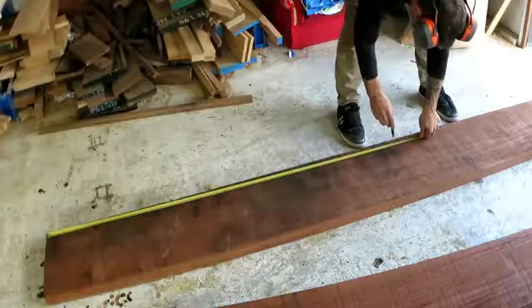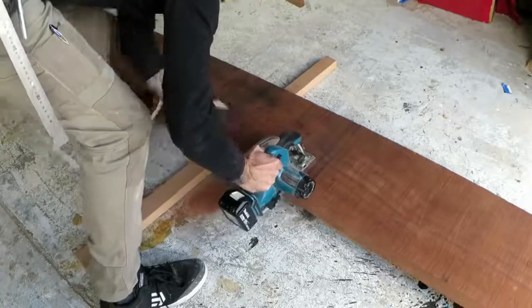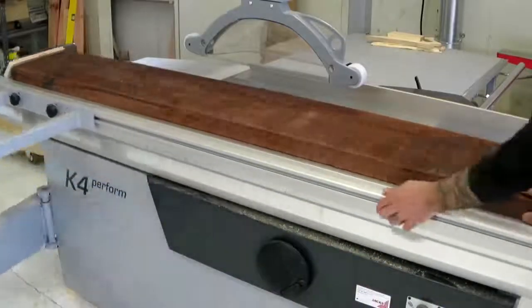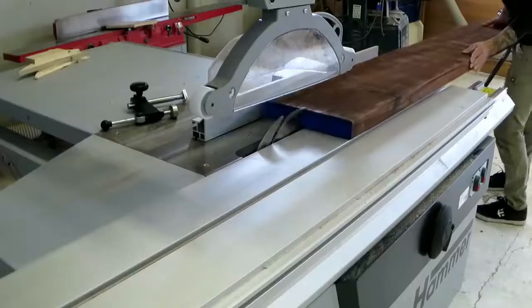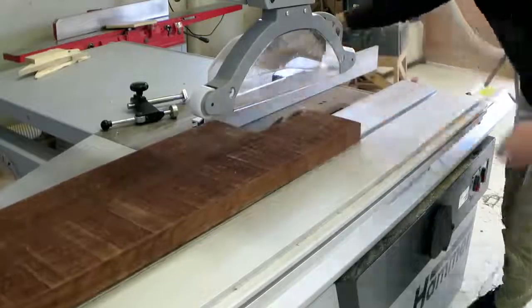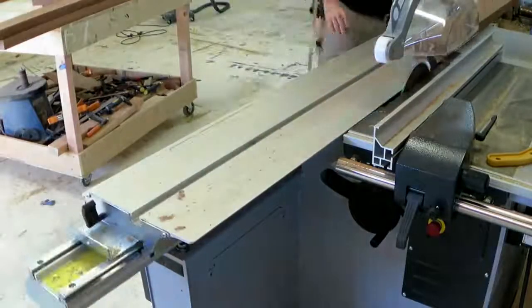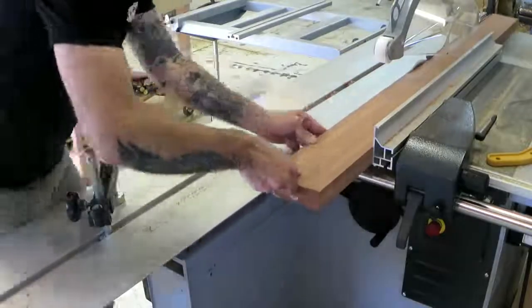Like usual, the first job is to sort out through my timber and work out how to break it down. I've got a new table saw, and this massive sliding table makes it super easy to straighten out a board. Just run it along the sliding table, run it along the fence, and you've got a couple of straight boards. That made it easier to thickness up the timber, and then once that was to the right thickness, I could go back and actually square up the edges with the sliding table and the fence. Really fast way to machine out timber.